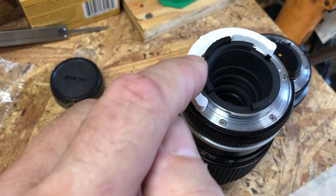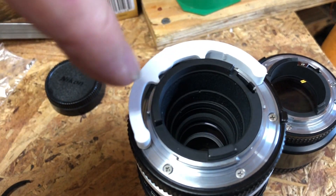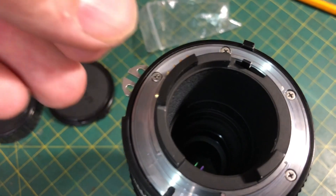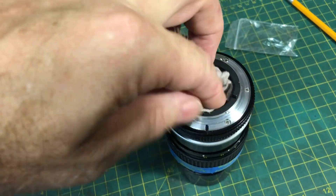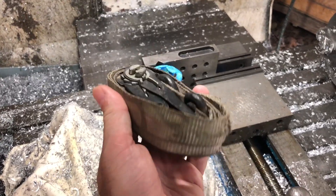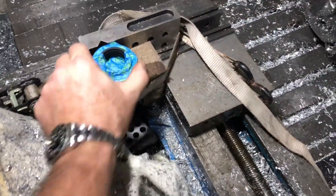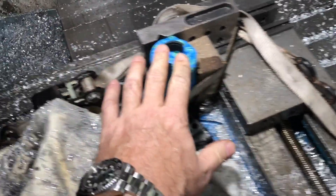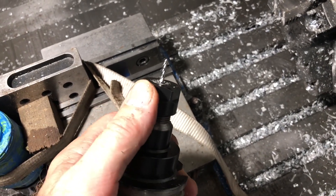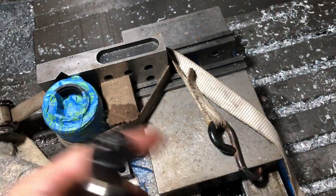I ran into my first problem. The chip fits onto a section of the lens that's not machined out for it. What I've got to do is put this in the mill, cut this section out, and make room for this chip so I can glue it onto the lens. In an attempt to not damage the lens, I'm going to clamp it with a ratchet strap. This is a pretty sketchy setup, but it's working. The lens is tight enough that it doesn't rotate, and I'm using a very small diameter end mill — it doesn't put a lot of rotational force on the part as you're cutting it, which reduces the chance of it moving around.